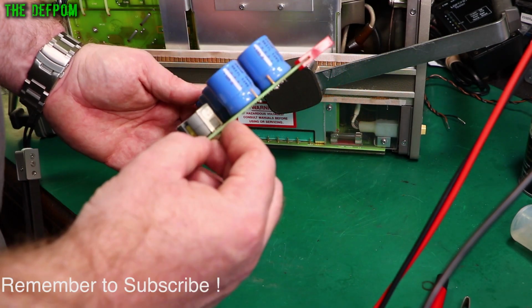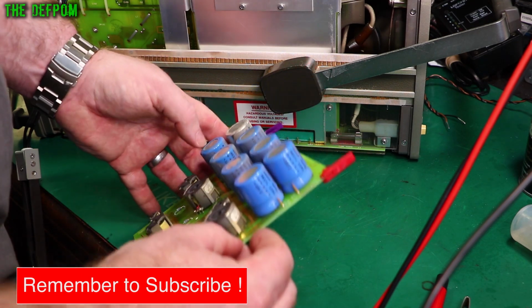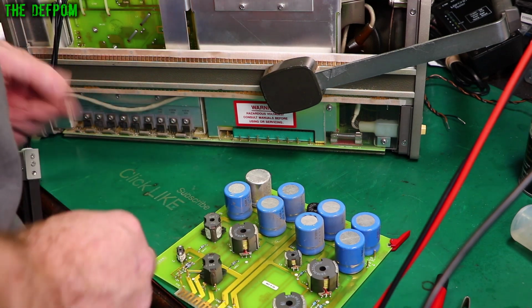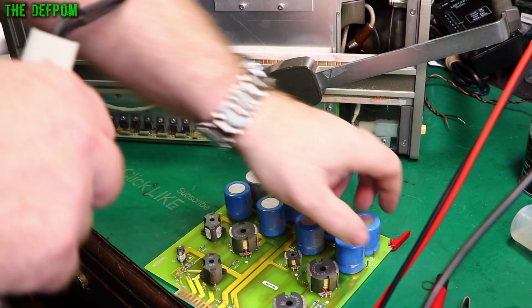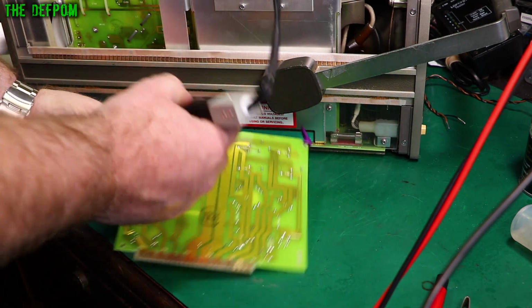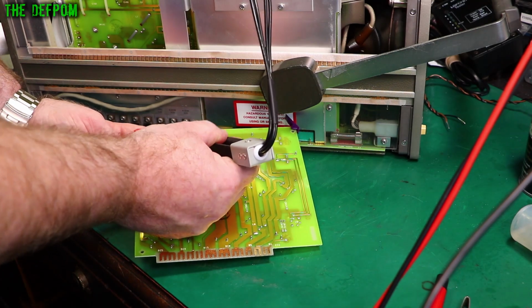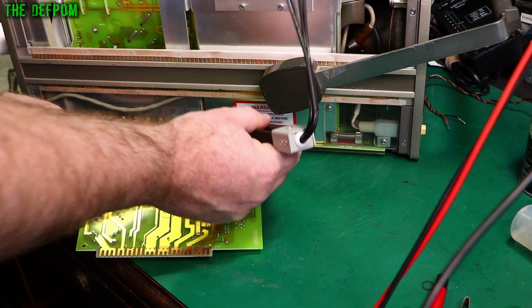Might be alright. It's also dated 1984. The other ones are dated 1986. So it's a different batch. That's from an older batch. So that's probably why that one's different. It may be nothing. Then let's do the same check with ESR and see if ESR throws up anything. It probably won't. Probably won't show anything really different. 0.06, 0.06, 0.06, 0.08. That one's slightly higher.